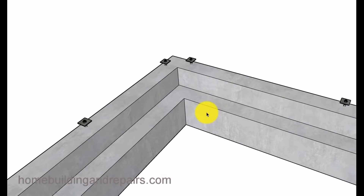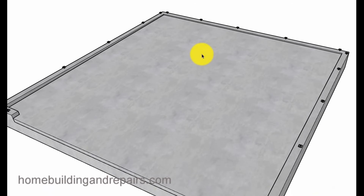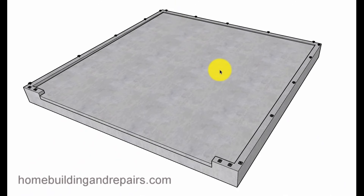You're going to have anchor bolts with a stem wall. Stem walls are usually six inches, or about five and a half inches, and the height would vary depending on the slab. The slab is poured afterwards — I've seen people pour these all together, but it's very common to pour them separately. Usually the slab is sloping towards the front. Any opening you have will need a curb, so if this raised stem wall goes all the way around, you'd need a break for the cars to get in. You would use this same method for a door opening as well.